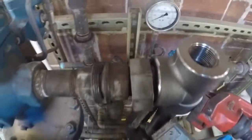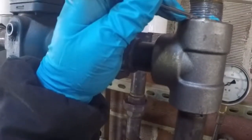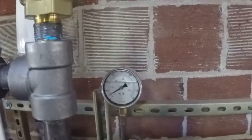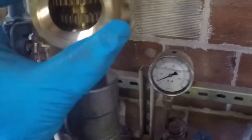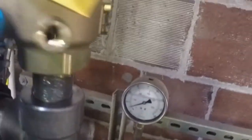Making sure we're pretty straight. As always, you see how we haven't covered the beginning threads? Now, even more important in this case, because any pieces of that tape, pipe dope, or anti-seize that gets pulled in will be able to junk up the workings inside of our valve. That will not be acceptable.